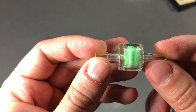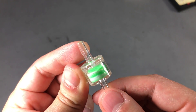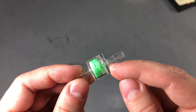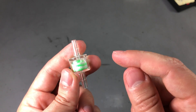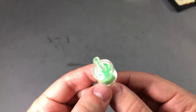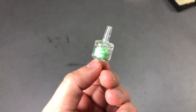My next product is a simple inline filter. The product listing said it's made of general-purpose polystyrene and fit for aquariums, so don't use it where filtering is more critical. It has 4mm ports so aquarium silicone hose should slip over them easily. I bought this to filter water being pumped from a small reservoir to some spraying nozzles — some dirt got into the tank and is clogging the nozzles regularly. After ordering I realized the filter may get clogged too, and I still haven't fixed the real issue of cleaning the storage tank. Anyway, you can find these cheap on AliExpress.